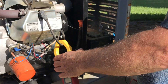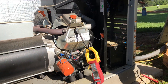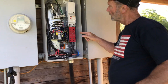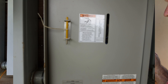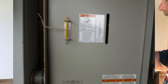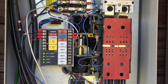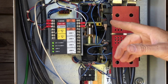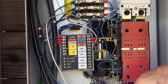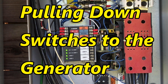I'll have to come back and check that battery when it hasn't been running. This is the transfer switch here. There's a little pin — you can't see it with this panel on, but it goes in that hole right there and you can manually trip it if you want to. One time the power had failed and this did not trip, so I just stuck the pin in and pulled it down and had no problems.